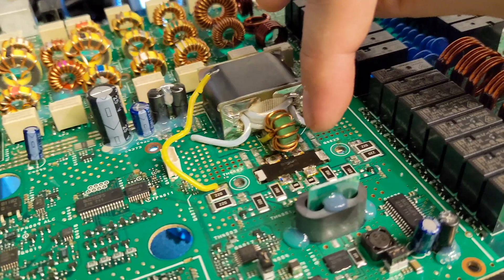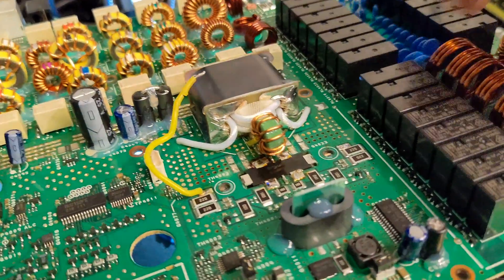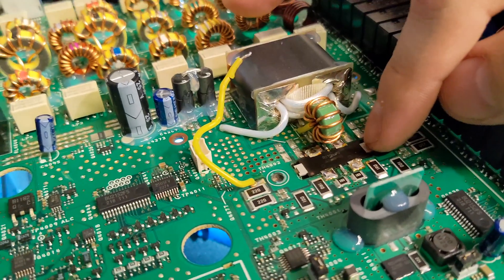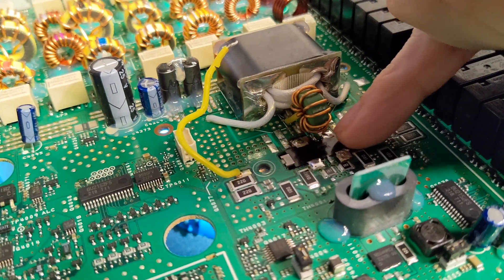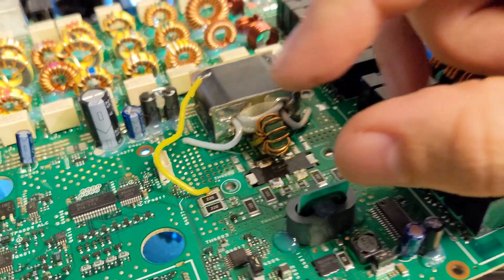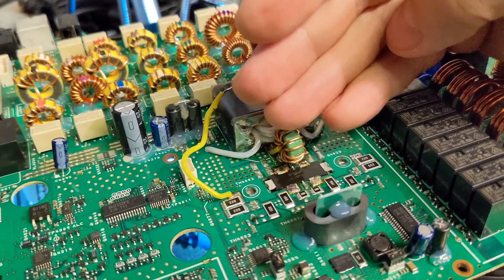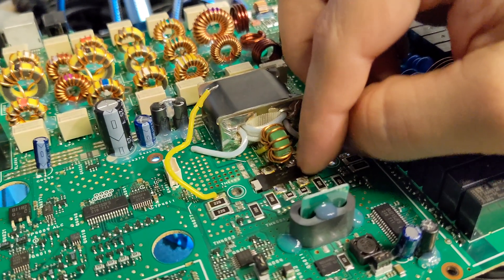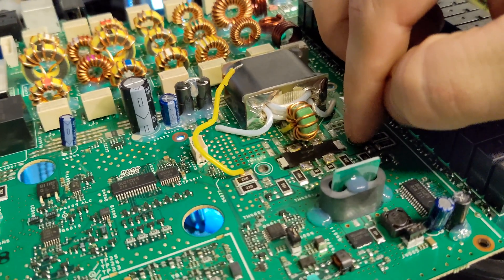This part's not coming out unless you flow that piece underneath and then lift the part out after the entire heat sink is up to the melting temperature of your solder, which is going to be around 600 degrees American - so 630, 650. If you're replacing it, now you know. There's a pad on the underside of this part that is intermetallically connected - this is alchemy for Christ's sakes. We've now created an alloy between the mating materials between this part and the heat sink on the underside.